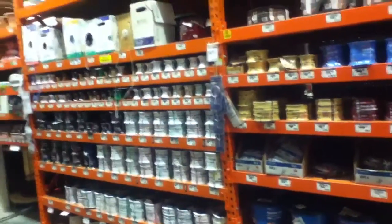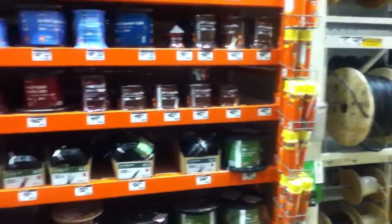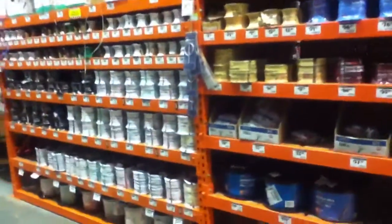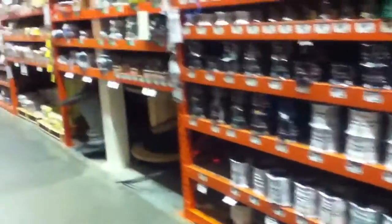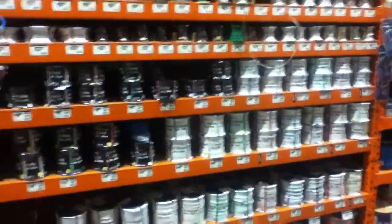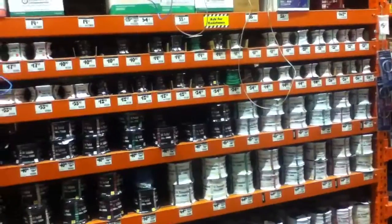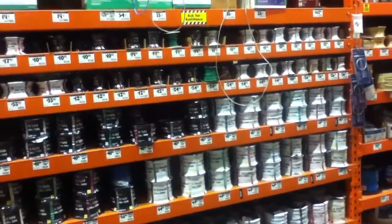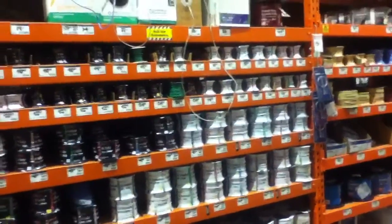Cable is rated by amperage. When they say it's rated for certain volts, that's kind of a guideline — volts is a variable, it's a range. When we talk about 12-volt stuff, that can be anything from 10 to 15 or 18 volts. When we talk about amperage, that's really the limit of the power that that wire can carry.